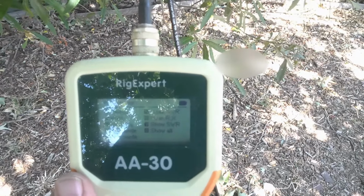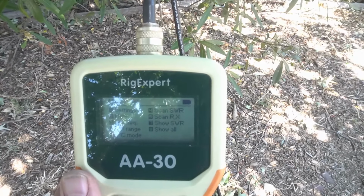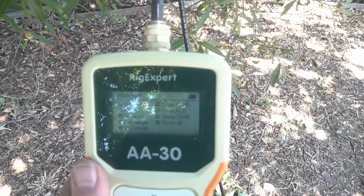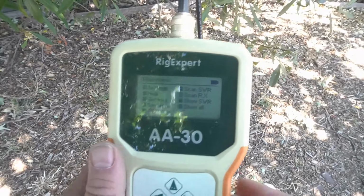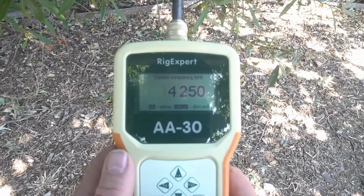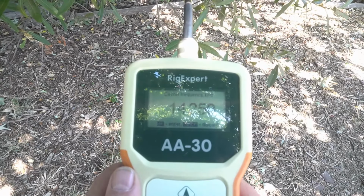All right, so I've cut 4 feet off of this already. So at 60 feet, I cut 4 feet off. I'm at 60 feet and I took 6 more inches off and I'm still long, I think, guys. Let's just look here. Okay, we're in 14.250. I think this one's actually pretty good. It's a little long on 40.